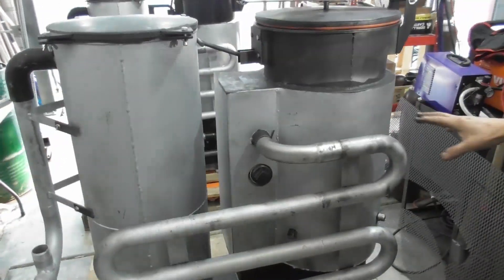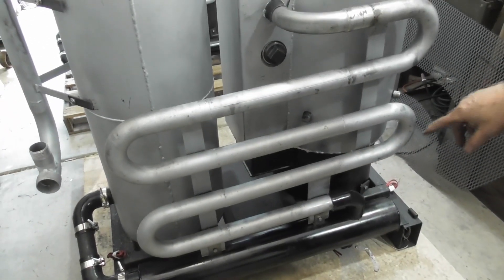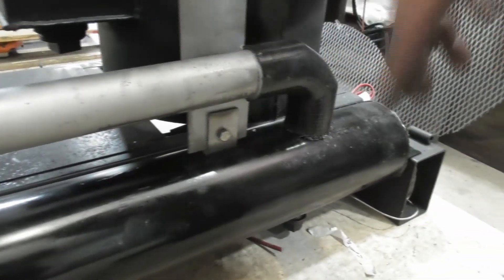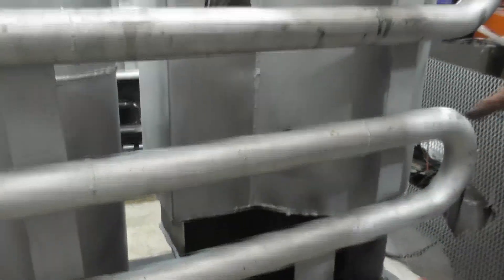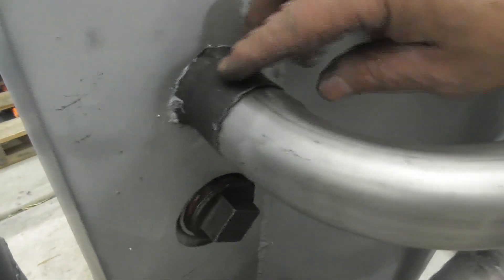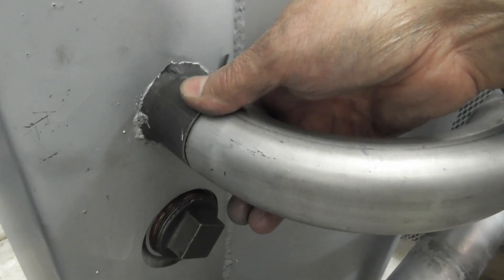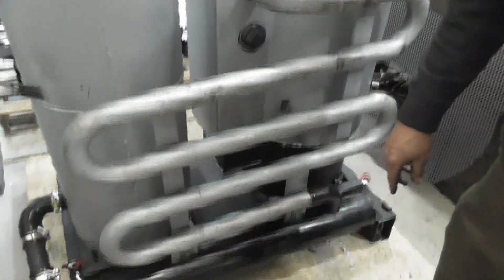I've got the cooling assembly sort of dry fit, and then I've got tabs where the tabs are going to get welded. They're held together by a 5/16th bolt. So we're going to dry fit everything, make sure we've got a good tight fit. Then we're going to weld those tabs on. This critical junction here where we're coming out of the heat exchange into the cooling — we want a good metal-on-metal fit here. So we're going to get everything tightened up, and once we've got everything with a good fit, then we're going to add the tabs.